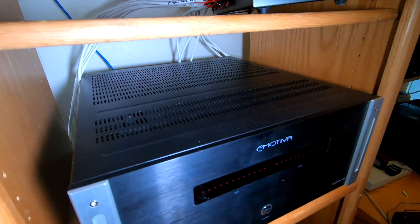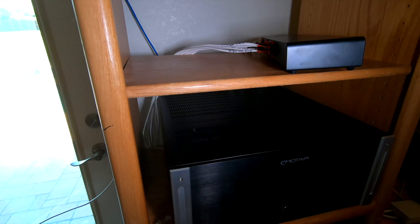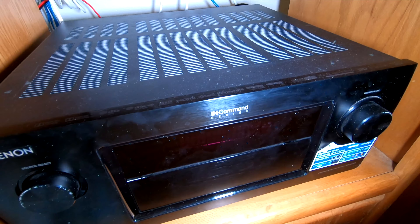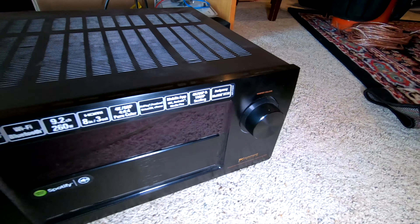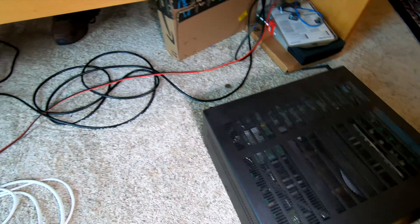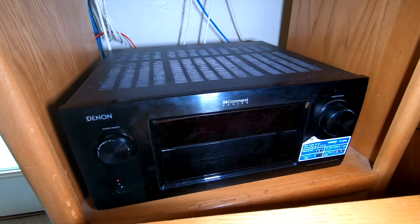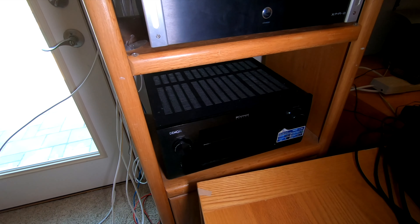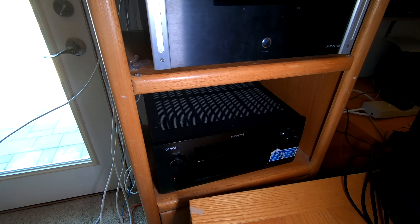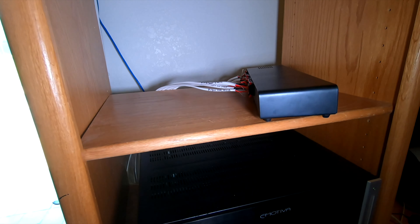The customer is going to be powering most of the main speakers for this room with this Emotiva XPA2. All of this equipment the customer owned — we didn't supply anything, we're just out here having fun. We've got the in-command series which is actually shorted out, so we're going to be transferring everything over to this guy, also an in-command series, the X7200W. The plan is to pull this one out and hook up his bedroom — there's a set of really nice stereo speakers in there — on Zone 2 so he can hop right out of the pool, go into his bedroom, and play music right to that zone from his phone. In here, it's going to be all manual push button: you can still stream to the main zone but then select on the speaker selector exactly which set of speakers you want to play.